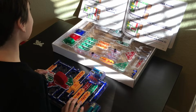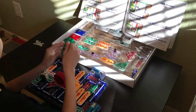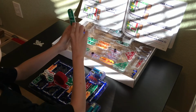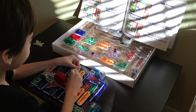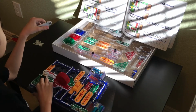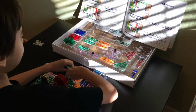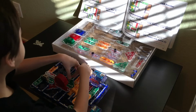anything else? Yes, we're going to be having the C4 capacitor, 100 microfarads. Orientation is critical. The plus needs to be here, not over there. That's going to go between this RV and the 6, right next to the R4 resistor. Oh dear, that looks like we have some incorrect positioning on that, but we'll remove this one because I think we put an unnecessary one down, so it's going to be just like this.